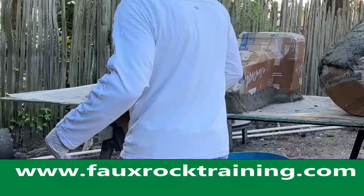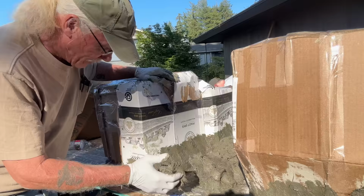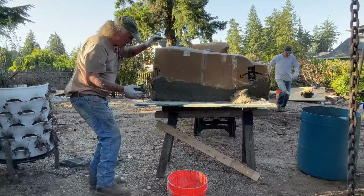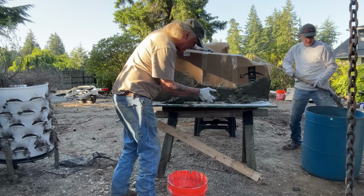Again, we're gonna mud underneath this one. And again, people, we're shooting for 3/4. I can make this even thinner with a formulation change, but now just kind of coming up about 4 or 5 inches up on the side. And again, you just keep going around and around the mountain and building this thing from the bottom up. And again, this other side. So we're just covering in lifts of about 4, maybe 5 inches up.